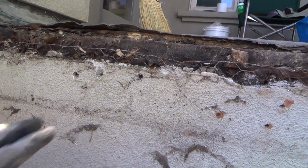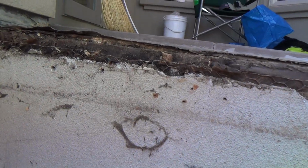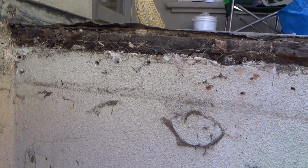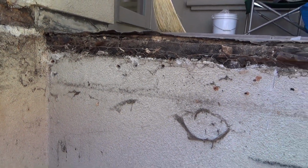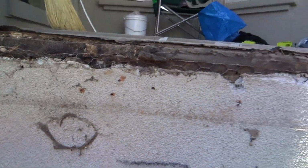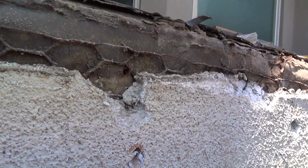Sometimes they do that now, sometimes they don't. Sometimes they put foam insulation panels on, strips that are maybe 2 feet wide and 6 feet long or something, and they nail that on first, and then they might put the chicken wire on after that. That creates a little bit of an insulating factor and maybe one less coat of stucco. Although this stucco is very thin.